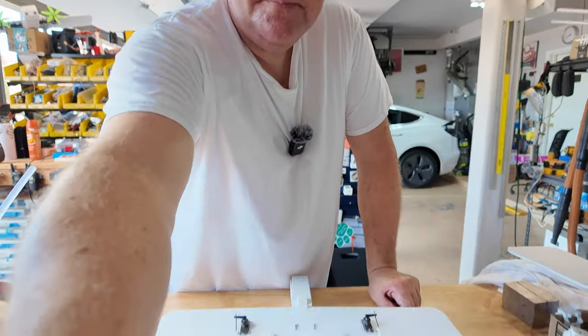The only other piece remaining is going to be this. This is going to be the closeout on the nose. And we have a vent with the tabs facing aft. So in order to get this to fit well, I just push down just a little, just like that, so that this will slide in, and this becomes that way. You put this piece in place and slide that aft and it locks. If it's a little loose, put a line of hot glue here. A heavy line will take up a little bit of space.